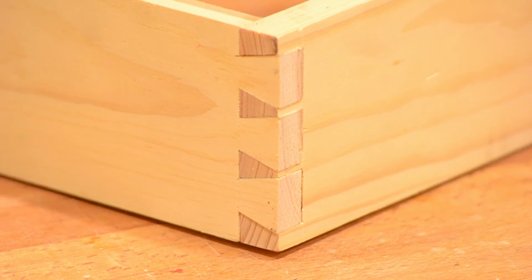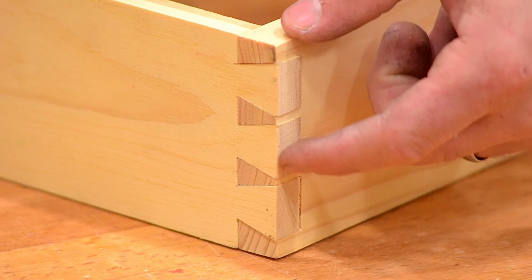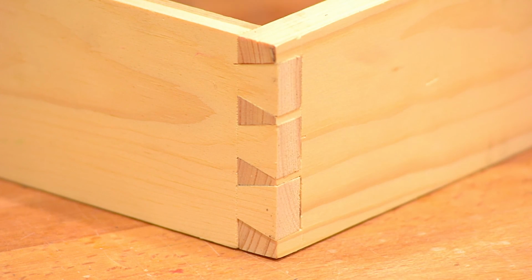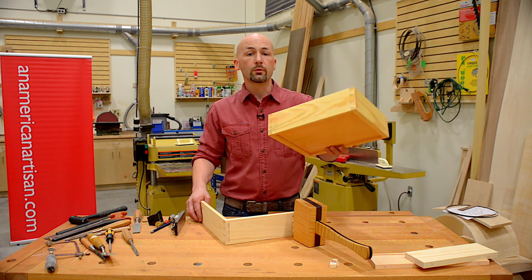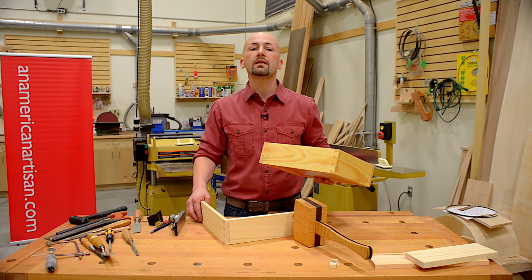So here's our completed dovetail. It'll take some time to get them to fit this snugly. I suggest that you start off with the softwood like pine and work your way up to some harder hardwoods like mahogany. Once you've completed all four corners, you'll be ready to glue up your box, and we'll take care of that in the next video.